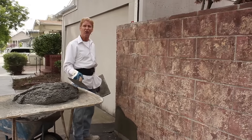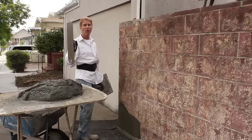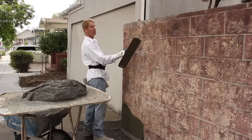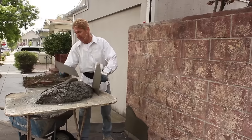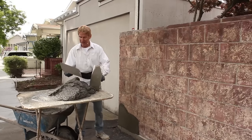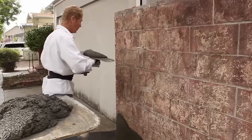So here's my suggestion for folks who are going to do this, because I've been doing this well over 30 years. Half-inch — what's half-inch called? Is it called a scratch coat or a brown coat? No, neither. It's called a skim coat. A skim coat is one coat — you don't have to do two, it's one coat. You can double it up, but you do one coat and I recommend a half inch over cinder block. Using my big congo trowel, you want to go a half inch.